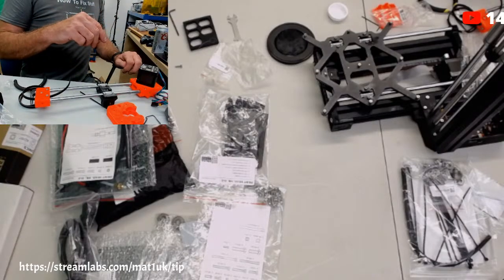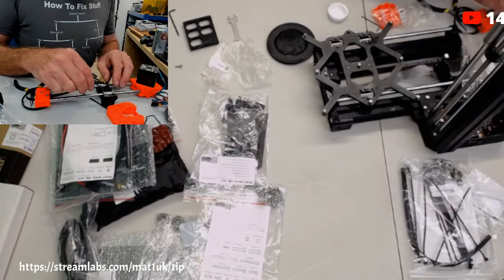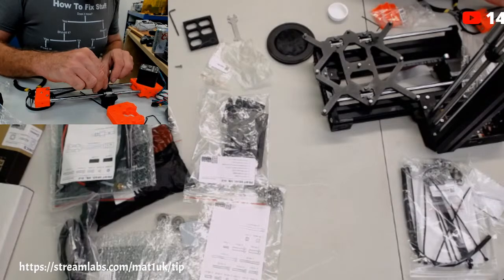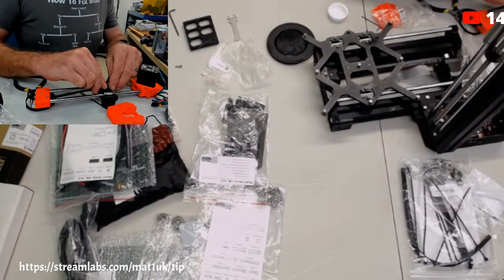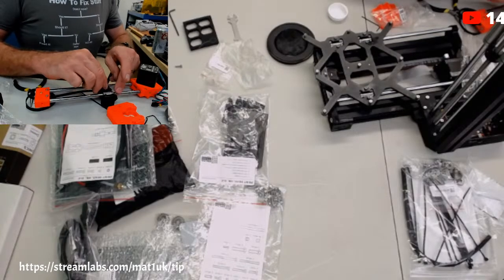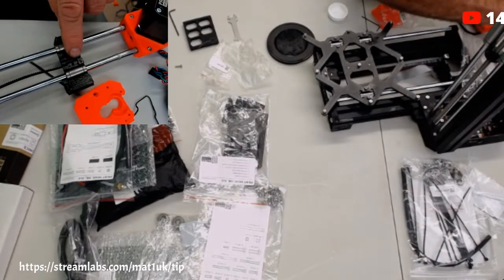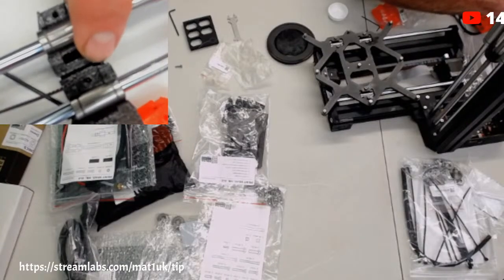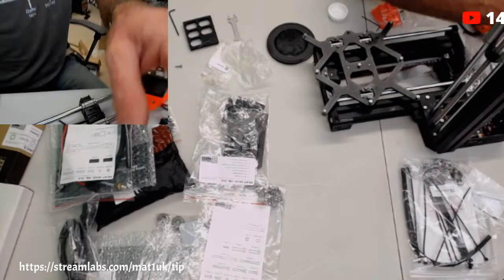Insert the belt along the entire length of the upper groove of the X carriage. So this is the upper groove, which doesn't go all the way through. It goes to there. So one must place it all the way along. I don't know whether you can see that. I shall try to do a bit of a closer in. I've got to go right up to there, and that's where it stops, and that's where it wants me to go. So it then runs that way like that.